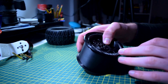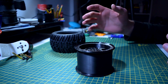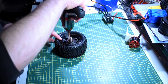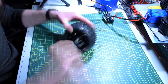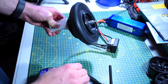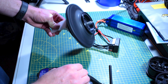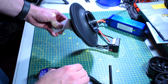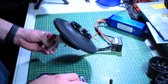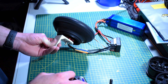Turning it on its side, you can see what's happening. The tire has a lip around the edge, and you jam that lip between the cylinder piece and the outer edges of the alloy, then tighten using the bolts on the front — it just locks the tire in place between those small gaps. It works really, really well. Using those seven bolts around the edge pulls the two outer pieces together and jams the bead of the tire between the center piece. The bead is holding really, really well even with a lot of force acting on it.